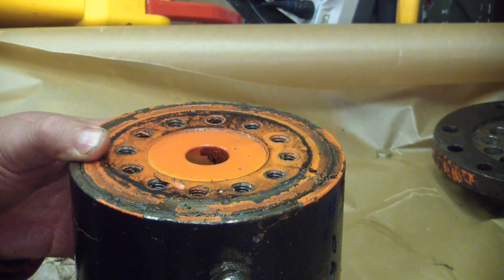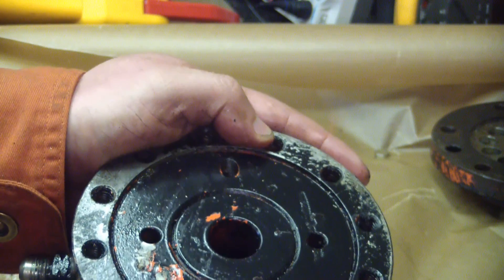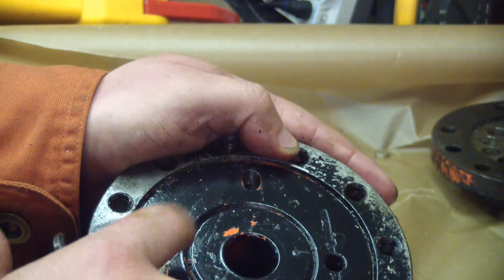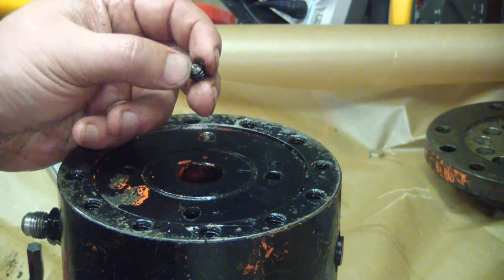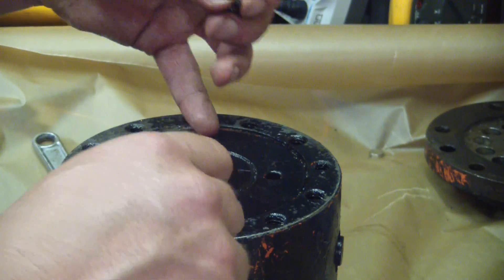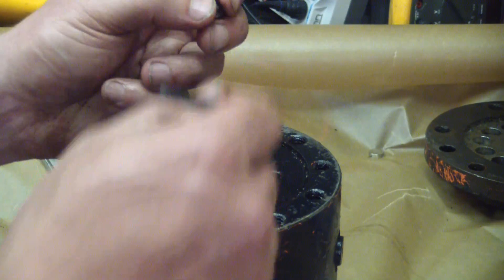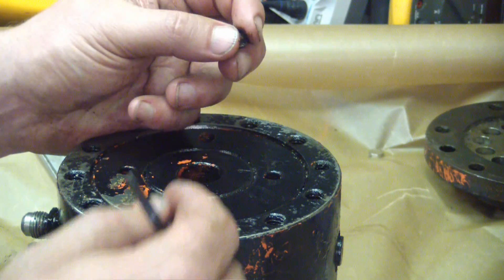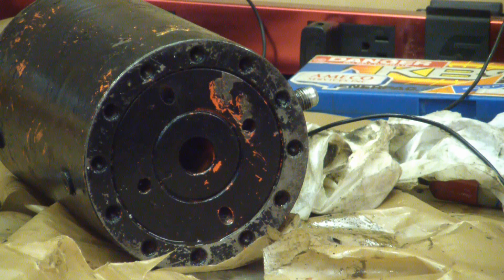How in the hell does this come apart? It looks like it comes apart with a face spanner — there are some set screws in there. I'll loosen off the set screws and quarter-ass a face pin spanner, see if we can get her. If not, we'll have to make a tool. Because this is American-designed in Maine, I can't tell if it's half-assery or if it's good design. To drill these holes you actually need to mill — you can't drill at that angle, the drill bit just walks away. You'd have to mill it then drill through, or plunge mill and tap. Interesting little design feature. I don't have a face spanner girthy nor long enough, so we're going to have to make one.